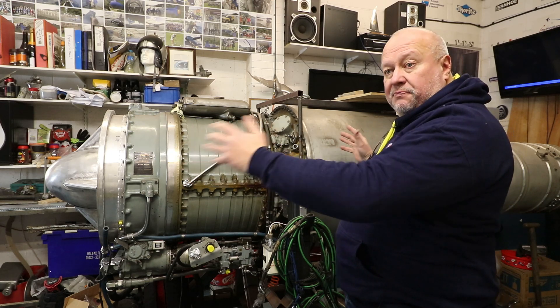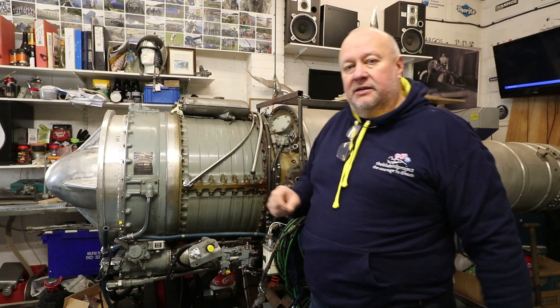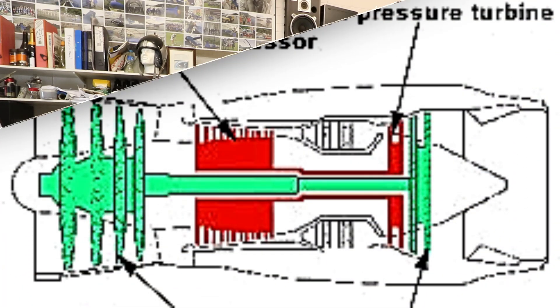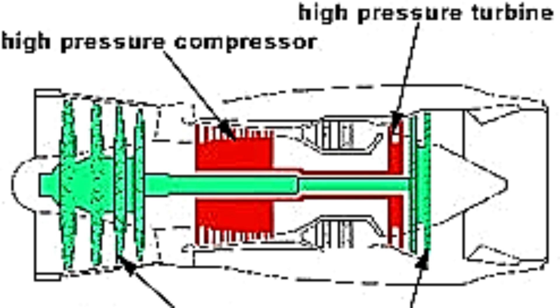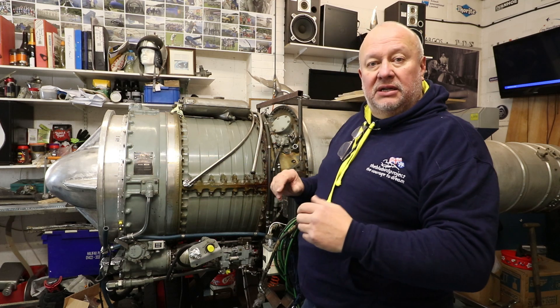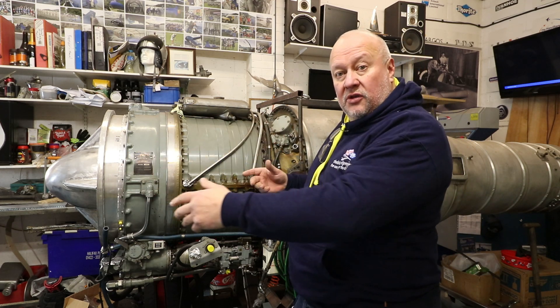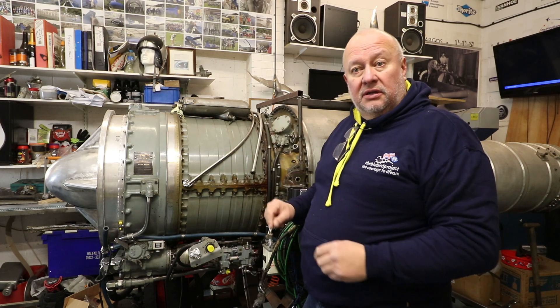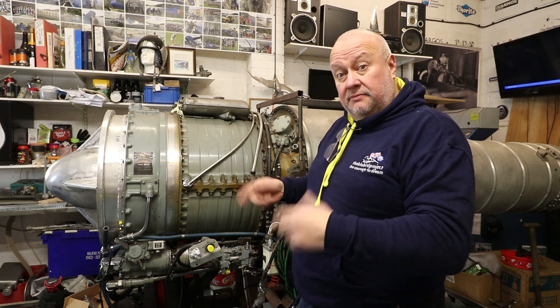You run this at its optimum speed and that would give you a much bigger engine, much bigger fire, a lot more gas — because at the end of the day it's a big gas-generating plant with a propelling nozzle. And it's really simple on paper: you make sure this spool has a hollow main shaft, then you put another shaft up the middle of it. On one end you put your new compressor and on the other end your new turbine, and you allow that spool to run slower but at its happy speed. That's a twin spool engine.